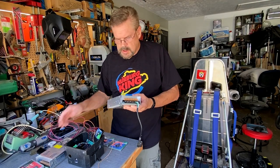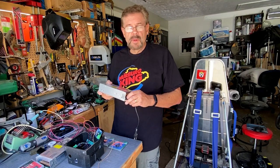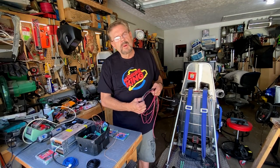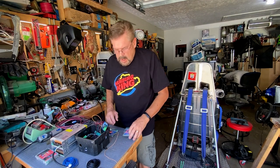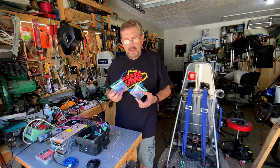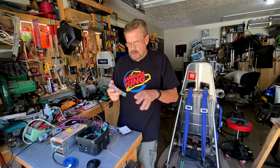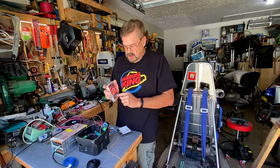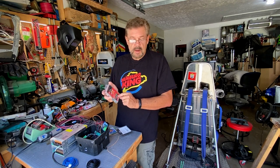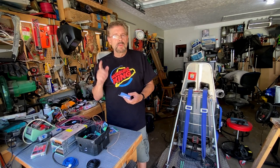The next thing is we're going to use these power supplies — it's coming off 25 amps, and we were able to measure pretty close to that during the load test. We're running a red for positive and black for negative, 12-gauge wire. Just for safety, we're going to put inline fuses — they're about a buck fifty at the automotive parts store. We'll use 15-amp automotive fuses. The pack has 15s, 20s, 25s, and 30s. I'm not going to use 30s or 25s, but I may do the 20s. We'll put this inline with the red positive.